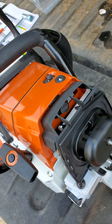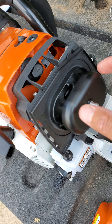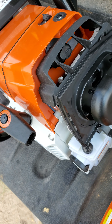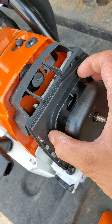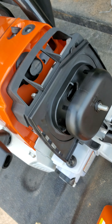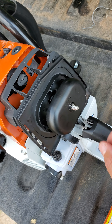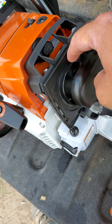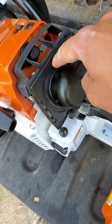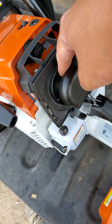I put a little vending machine lube — it's food-safe vending machine lube — around the base. Because what happens is you don't get a tight enough seal on the 500i because it doesn't have this. It just locks into place, doesn't screw. And you don't get a tight enough seal, so you're gonna get sawdust going into the area under the air filter.